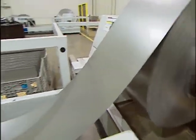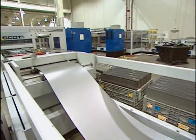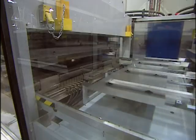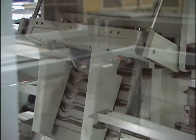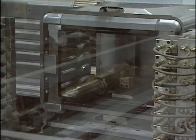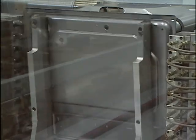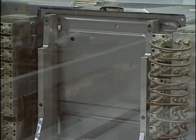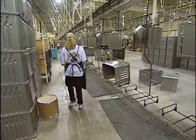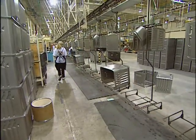On another production line, another roll of steel is being cut into longer sections. The sheets are turned around, fed into the press, and molded into a familiar-looking form that will become the oven cavity. The whole process is automated and controlled by computer. The back is attached, and the oven cavities join other components that have been molded by other presses, ready for the next step in the process.